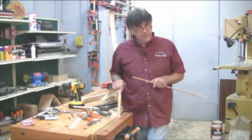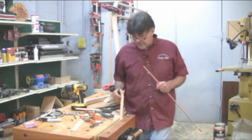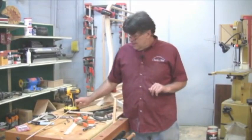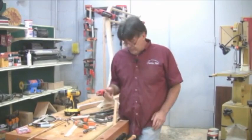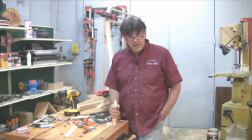Also be careful anytime you're doweling anything, just like we did on the peg. Make sure you've got glue, but you don't want too much. If you get too much glue, you create a hydraulic effect and you can split your wood. So all of that is to say there are many, many ways you can create this little half inch round tenon. Or you can do like the original and chisel out your uprights to a square, just the way it is. Not difficult at all.